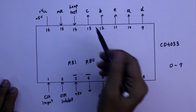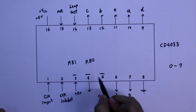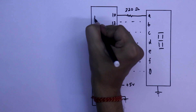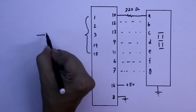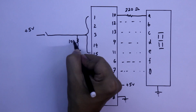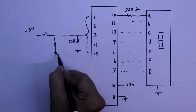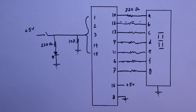In this video we are going to see the working of pin numbers 14, 15, 1, 2, and 3. In the next video we will see pin numbers 3, 4, and 5 in detail. Pins 1, 2, 3, 14, and 15 are all input pins. I am going to connect a switch to provide input to each. The other end of each switch is connected to plus 5 volts. Since these are input pins, we have to connect pull-down resistors of 10 kilo ohms. We will also connect an LED with each switch to see whether it is on or off, using 220 ohm resistors.